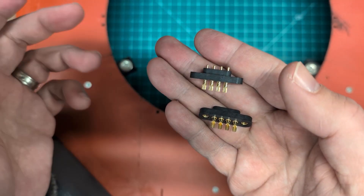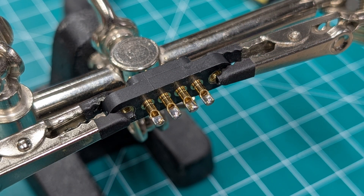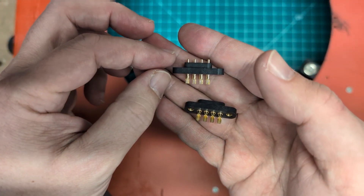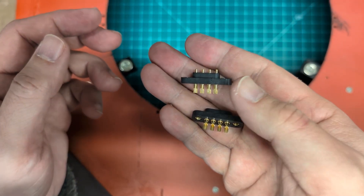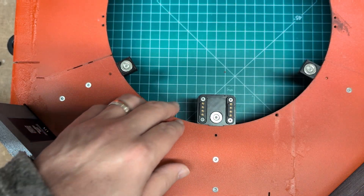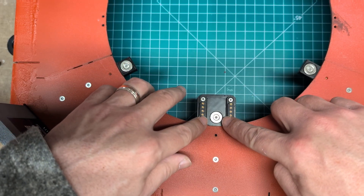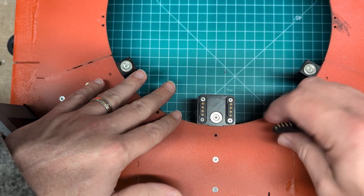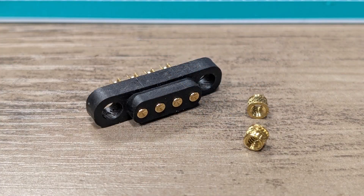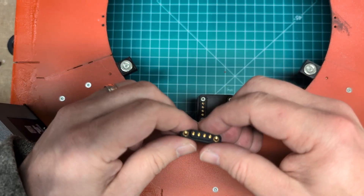Assembly for these is very straightforward. All you need to do is tin your wire, lay some solder in the soldering cup, then heat the two together and you're done. Just don't forget the heat shrink. Also make sure you don't over-tin the wire — if the tinning goes too far up, you're going to have a hard time making the bend. It's imperative that these be completely flush so that they mate perfectly with the mounting plate. I got them through Digi-Key and found I had to remove the heat sets, chamfer the edge a little bit so that the flathead screws sat nice and flush.